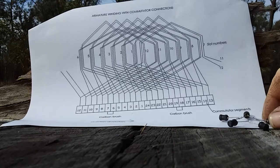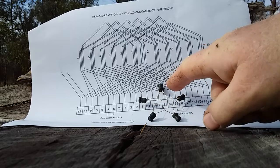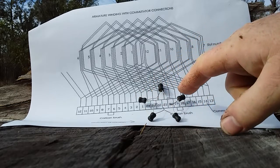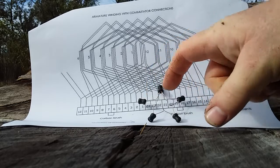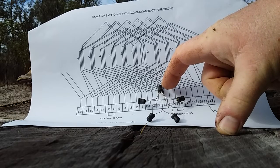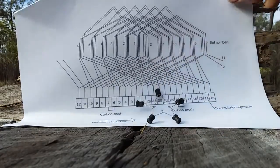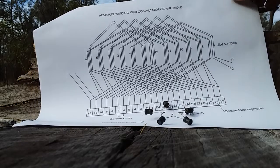Back to our analogy — if that segment and that segment are connected, then this coil is the low impedance coil. These other coils are high impedance coils: one, two, three, four coils. So the current connected to these segments will have two paths to flow. The first path, which is the easiest, is through the lowest impedance — the lowest resistance.